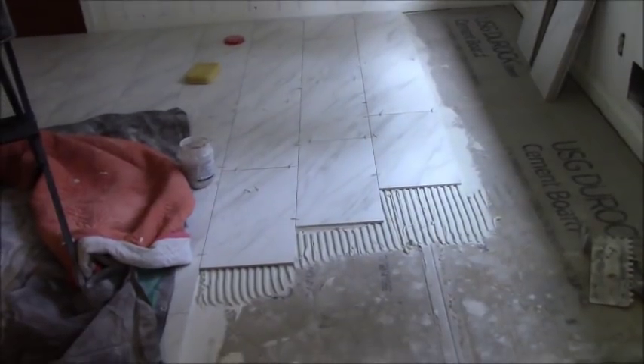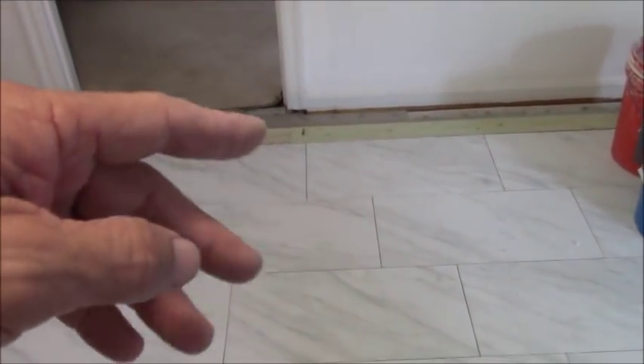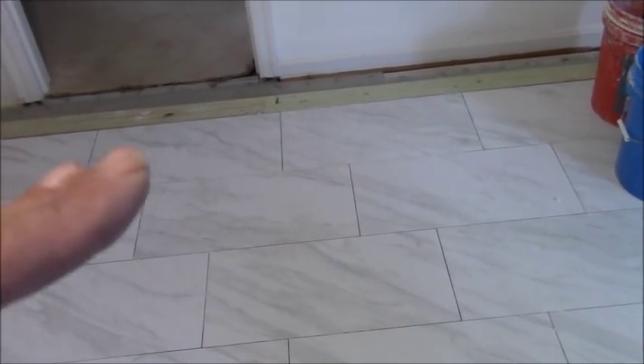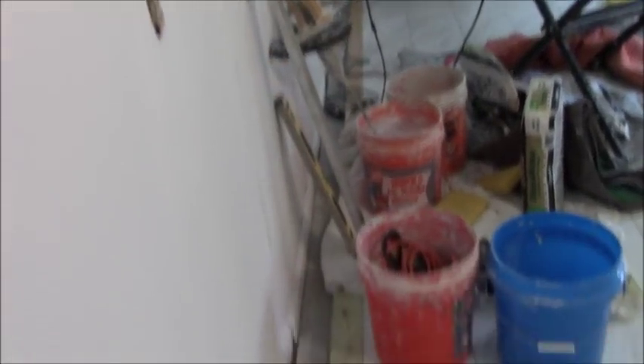This is the next day. All that tile was set, dried, and ready to be grouted. However, I still have this whole other area to do — about three more rows coming all the way back, and then the last couple tiles, about two and a half, going on the back part last. As I mentioned, you set your first tile last — same as with a ledger board in a shower. It gives me a straight line for the tile to come out to, and ensures the same cut dimension all the way down, so I don't end up with cockeyed tile cuts.